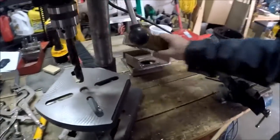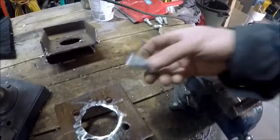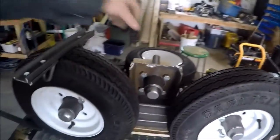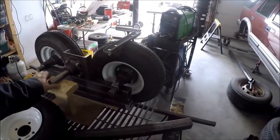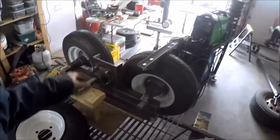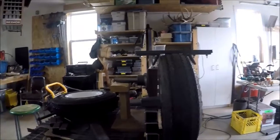I built these brackets to mount the hubs to pivot the walking beam. I've got the holes all drilled — they're 5/8 holes so the bolts are half inch, so we have quite a bit of gap in case there's any out-of-roundness. Over here I've kind of laid this all out. You can see there's the walking beam, there's the hub used as a pivot, and I just propped it all up. These are at the right height, there's the little sleeves and the pivot. I started thinking about whether these guides are going to hit, so I lined this all up and it looks like it's going to clear — there's a bit of gap there.